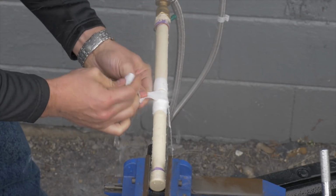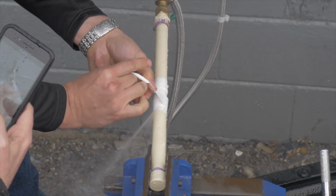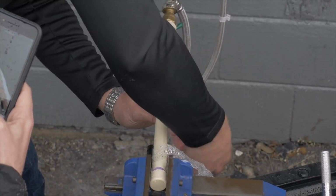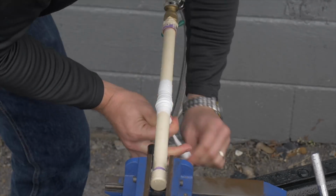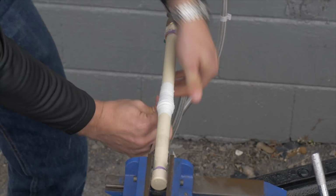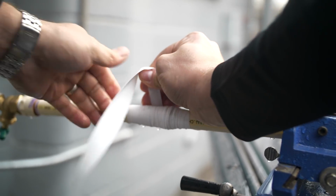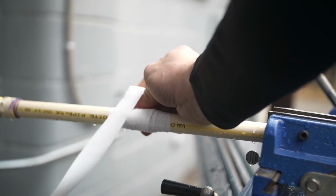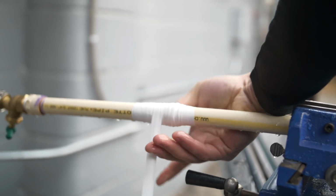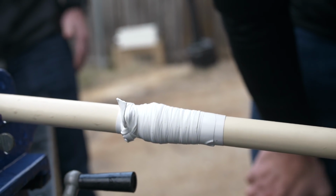Now what you're gonna do, here's the method. You're basically gonna wrap several times on the left-hand side of the leak, come over to the right-hand side and wrap several times. And then when you get to finally wrapping over top of where the leak is, you're gonna get wet, don't get me wrong. This is definitely something that's gonna get you soaked. Wear a raincoat. But once you wrap that enough times, get a nice stretch on there, because this stuff does elongate about 300%. Stretch it up nice and tight, wrap it all the way around, and once you get enough pressure on there, believe it or not, you can get that pipe to totally seal an active high pressure leak. That is pretty awesome. You're not going to do that very often, but that's a really good tool to have in your tool case.